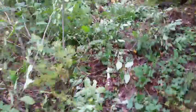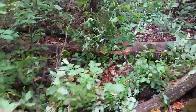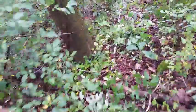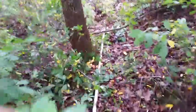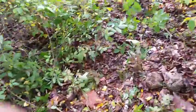So in this case, I didn't even bury the PVC pipe. You can see it just runs along through the woods here. The reason that I didn't bury it, simply time factor. Was busy building, and also because it doesn't really hold a lot of pressure. Traditionally a spring does not have high pressure unless it's an artesian type, and even then your spring box is simply going to let the pressure out if it's too high, and your pipe is not going to hold that much pressure. So it's rarely full all the way, so when it freezes, the pipe ends aren't even glued together. It can pop itself apart, and it's not a critical factor even in freezing cold weather.